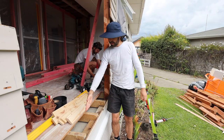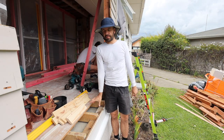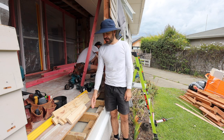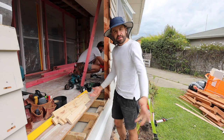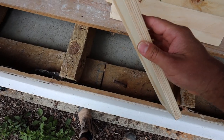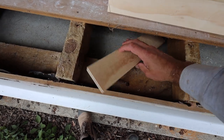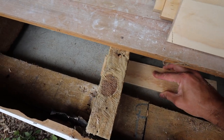Because we need to cut along here, the floor's going to drop. We need a solid seal here for our door, so we need to get rid of these. We also need to support the floor so it doesn't drop — that's what these are for. Bit of LVL ripped down.